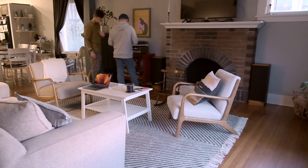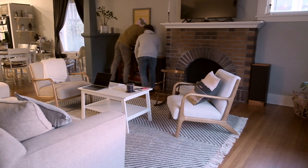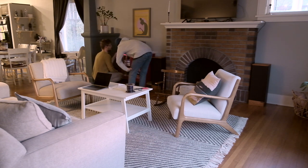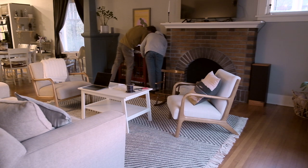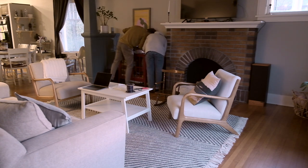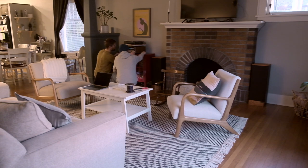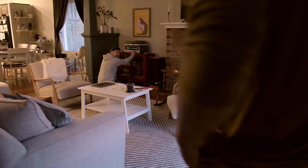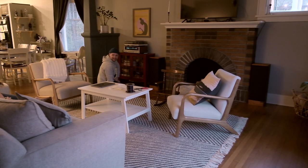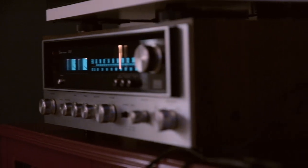The installation was going smoothly until we tried to play music out of the receiver. It was on, all the lights were on, everything seemed to be working and hooked up, but we just couldn't get any sound out of it. I had tested it a couple days prior so it was working, and I was starting to think I'd have to take it home and work on it again — until I finally said, let's just disconnect everything and reconnect it. We disconnected the speaker wires from the speakers, even though they were very securely in the connectors, took them out and put them back in, and it worked. I'm glad we could get it working and enjoy some music that night. We both thought it sounded really good.